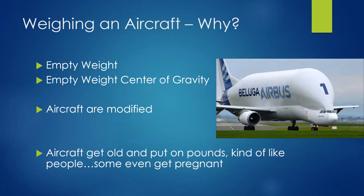The accumulation included HEPA recirculation filters that would be completely packed with hair, dust, and debris. Most of the weight gain was moisture from people breathing, soaking into insulation blankets, plus dust, dirt, and skin cells sloughing off into the carpet and air ducting. When you pulled the HEPA filters out, they'd have a whole wig stuck to the side of them. So aircraft do gain weight over time, which is another reason periodic re-weighing is necessary. We're at a good break point — when we come back, we'll get into the actual weighing process.